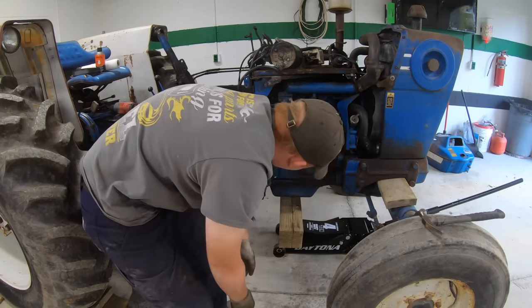I believe this rear main seal here, there's oil up here though. So I hate to say that that's our smoking gun, but I mean it's dry all around the transmission, so I don't feel like that seal's leaking. I'm gonna drain out the transmission oil on this because it looked pretty milky. Plus I have the transmission input seal out.